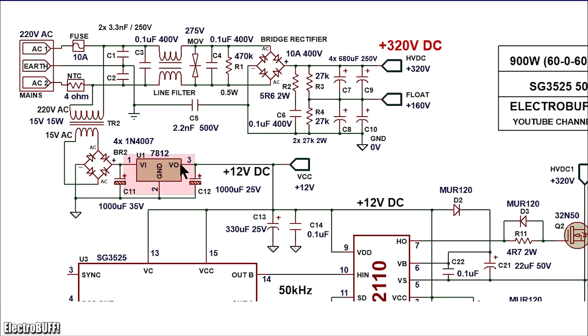To power the control voltage circuit, you'll need a step-down circuit to provide about 12 to 15 volts DC. This is built around the 7812 linear regulator and a small step-down transformer. This steps down the mains voltage to about 15 volts, which is rectified by a bridge rectifier and filtered by capacitors C11 and C12 and the 7812 IC to obtain 12 volts DC. Also note the ground references — you have the ground referenced to the mains earth and the circuit ground reference of 0 volts.